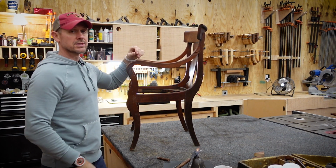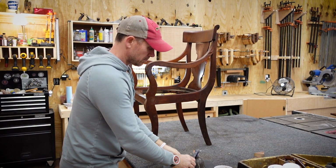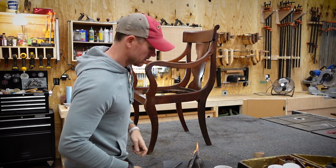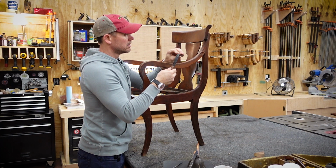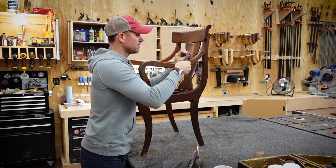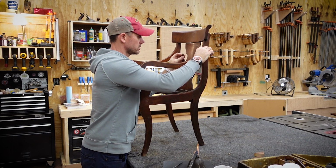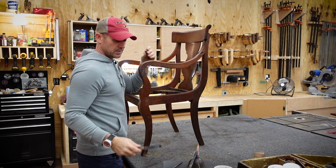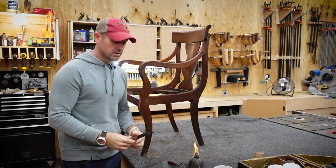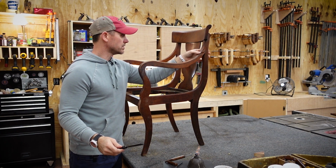Normally, an operation like this, to get this filled, it takes about 5 minutes, tops. It's not a very involved process. It doesn't take really long to do it properly. So we're gonna repeat the process all over again. Making sure that my lacquer is not too hot, and starting on one side and pulling directly across to the other side, as smoothly as possible. Okay. And then we're gonna wipe off the excess here, put my knife back on here, and we're gonna make sure that this cools for just a second.